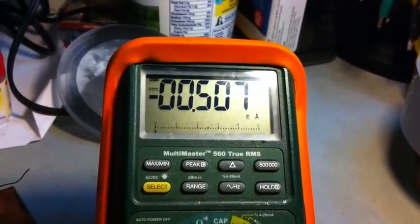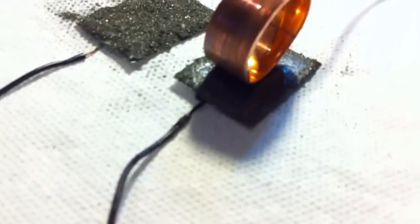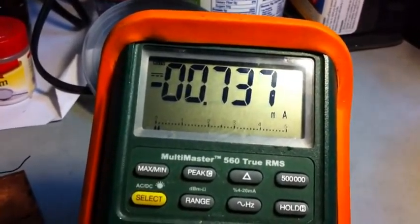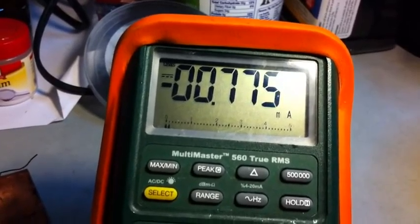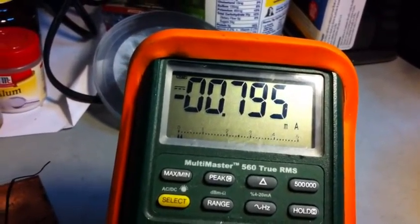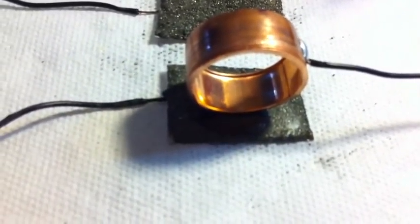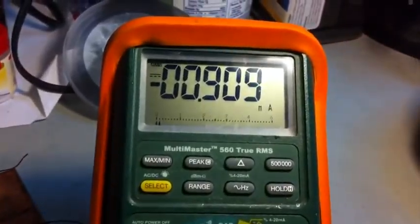It's going to grow to over a milliamp. Without any pressure or humidity — the silica is just drying. I'm going to show the resistance: it's in mega ohms, the resistance between the magnesium and the top surface of the iron pyrite. We're talking mega ohms, and I'm still producing over half a milliamp. Interestingly, it grows only when you use it. If I connect and let it rest and connect again, it drops — so it actually likes being used. I'm pretty sure this magnesium is not being corroded. There's no water, just silica. It will become glass. Just copper, magnesium, and iron pyrite. I am absolutely puzzled by this.